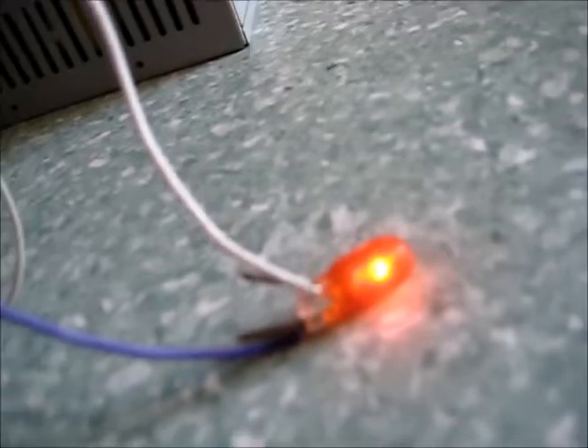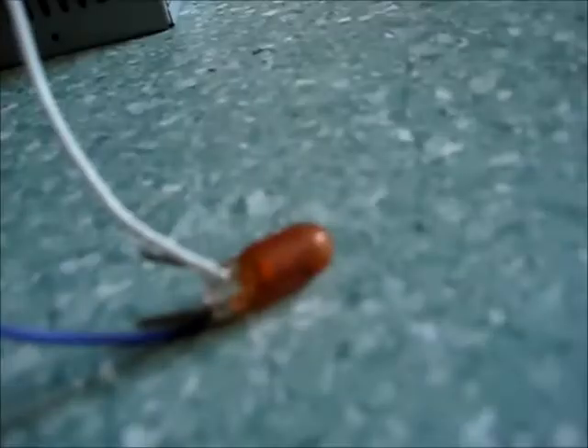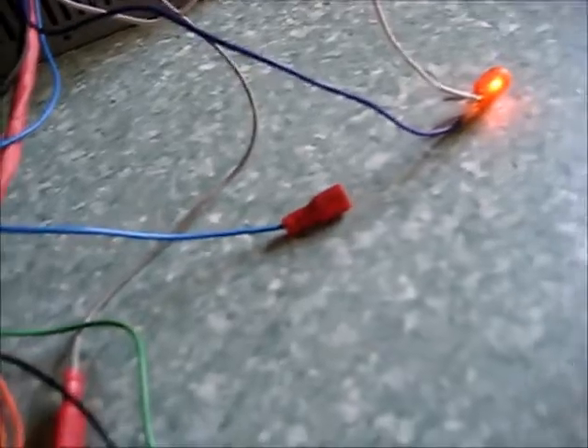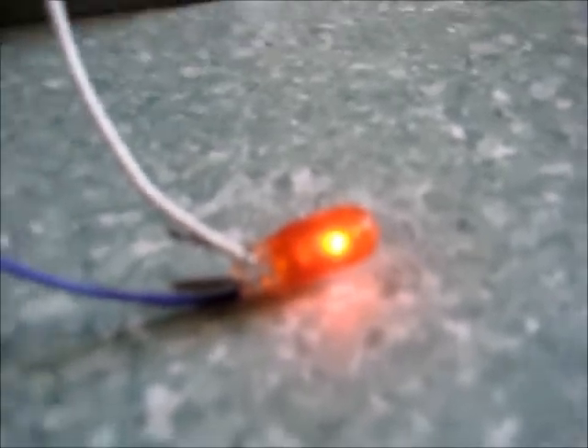That's my 5 volt standby light — it's on when the power supply is off and it's brighter when I turn it on. I've got a bad connection so it's not staying on. That's off and it's on standby. Now I've got these two together giving sixteen volts off the grey together, so I can run a sixteen volt load, or each off the black which gives a twelve volt load. I'll need to get an LED holder and solder a little LED on there for the standby indicator. That's all done — thanks for watching.